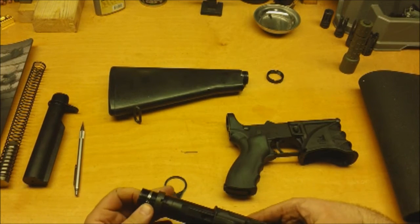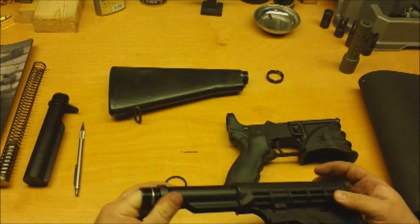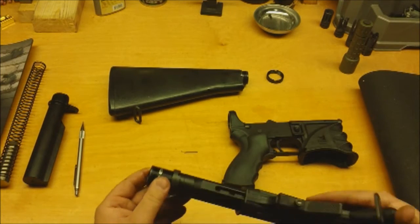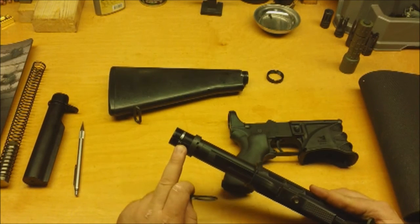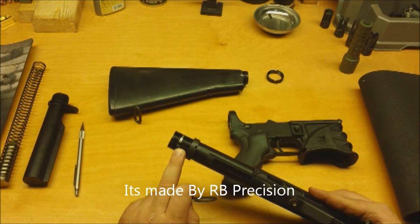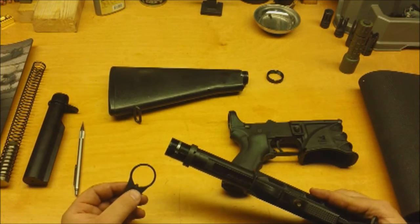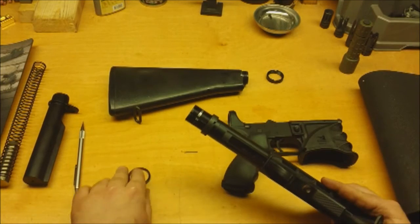This tube — while I don't know exactly what material it was made from — was most likely made from a 6-series non-heat-treated aluminum, and it feels as if it was extruded and had the end cap welded into place. I'll explain how to tell that in a minute. Just to show you the inherent weak point of the buffer tube: I've actually had an ACE SOCOM stock, which is about a $200 stock, and at a training course I fell on the rifle the wrong way and it stripped my American-made buffer tube as well.